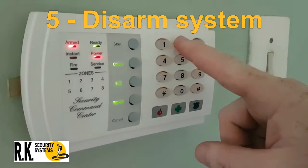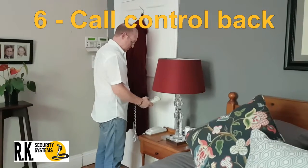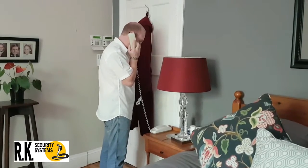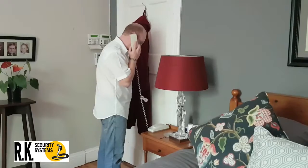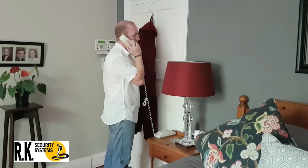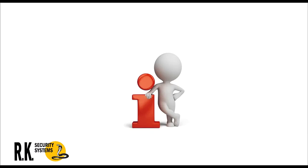Step 5: Wait 30 seconds before disarming the system. Step 6: Call the control room and check which zones were received. Zones which did not activate or were not received may be retested or logged for a technical visit. Confirm that testing is over to avoid confusion, note an OB number if required, and get the name of the controller you dealt with.